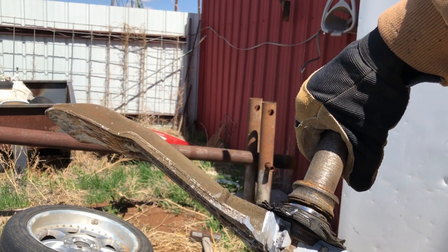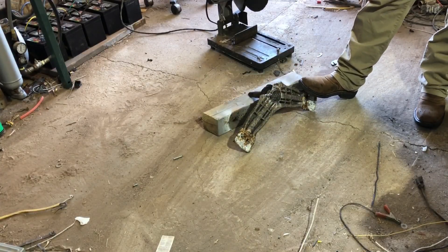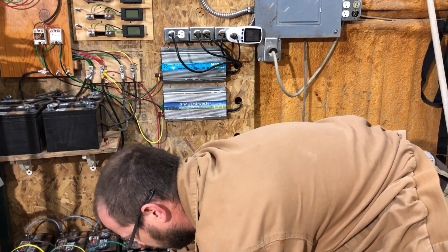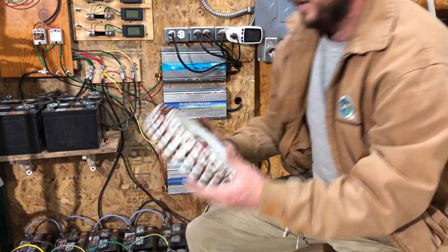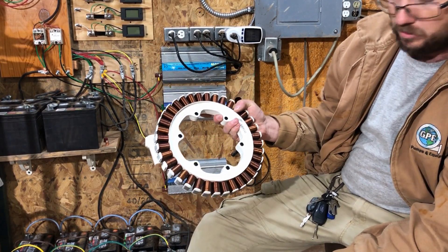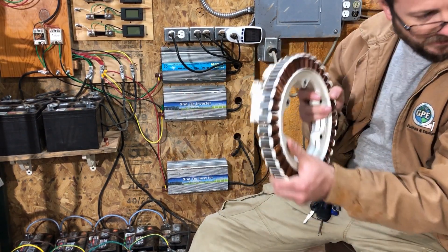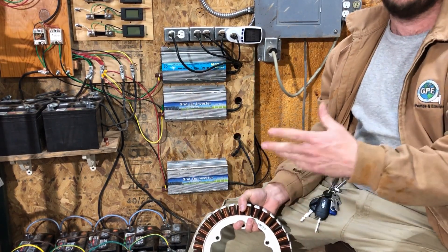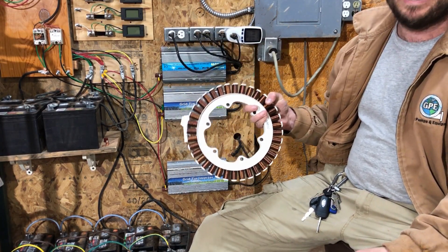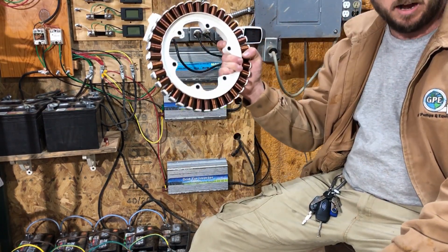It's cast around that thing — no wonder I couldn't press it out. In the end I got a better stator. That other stator was aluminum; this one is copper, which is just a better starting point. Generally the copper ones are liked better. I did have good results with an aluminum one before, but the one out there right now making 700 watts whenever good winds hit it — that's copper. So we've got a copper stator.